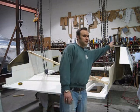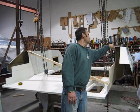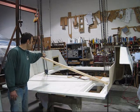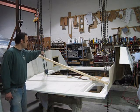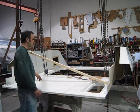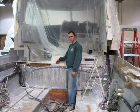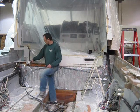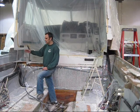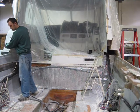Up here, this is another insert that we had just to extend this surface, so that'll have to be sprayed a non-skid surface. And you can see back in the corners here, we're going to install the lockers before we put the deck onto the hull. Inside, the deck's going to fit right over this flange here. Starting in this corner, it's going to be all glassed together. So we've cut our deck to fit so it matches the other deck all the way around.